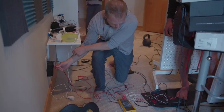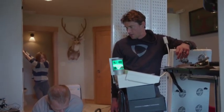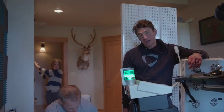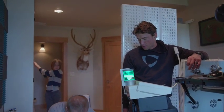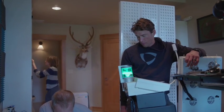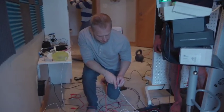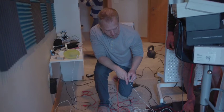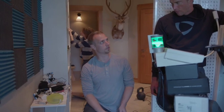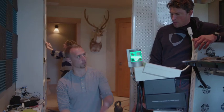So what he's testing, River and Taryn, is the amount of grounding current produced by the outlet in the wall versus the amount delivered from a stake planted out in the ground. And the amount delivered from the wall, you're saying, is more, Brian. Yep, and you're also getting transfer of AC current. This is why, when we recommend shielding and grounding, everything has to be grounded at the same location. If you have two different ground potentials that are 300, even 100 millivolts apart, there's going to be an influx of energy from one place to another.